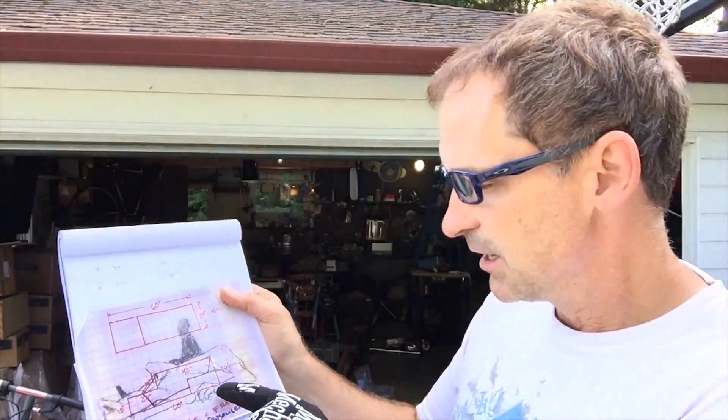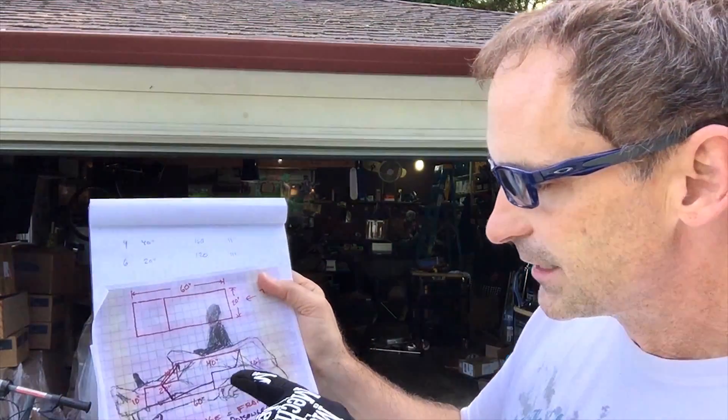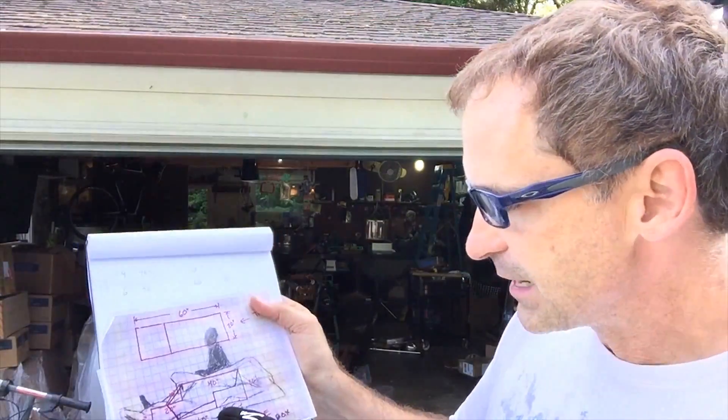I have to be careful to use lightweight materials. Now, you might say lightweight materials — this cart has to be crazy strong. Yes, it has to be crazy strong, but I'm keeping in mind that as I keep building, there's going to be more and more material added and it's all going to be connected and keep itself strong. If you took the body panels off of your car, your car would not be anywhere near as strong and rigid as it is with the body panels on. Those super thin pieces of lightweight steel that form the skin of your car keep the car really strong. So I'm going to use the lightest weight steel I can for the frame, because I know I'm going to build over it and over it and it's going to end up being a super strong thing. If I do it otherwise, it's going to be like a 1953 Chevy — really big, really bulky — and I'll have to build a crazy strong track to support it. So with that in mind, I'm going to chop up the lightest weight pieces of steel I've got here in the shop.